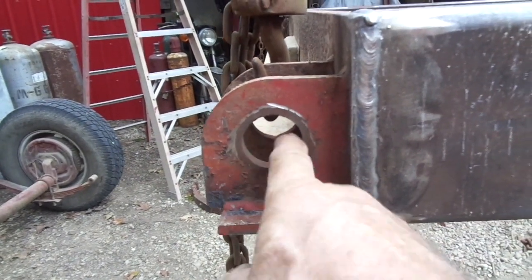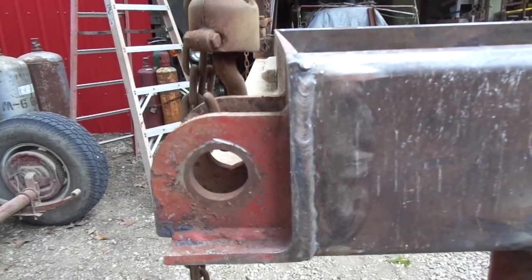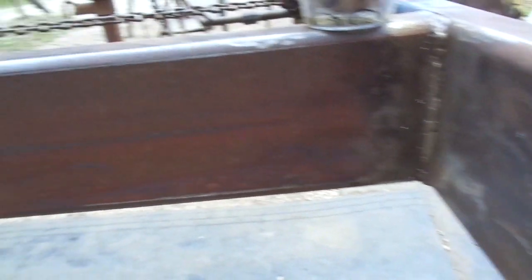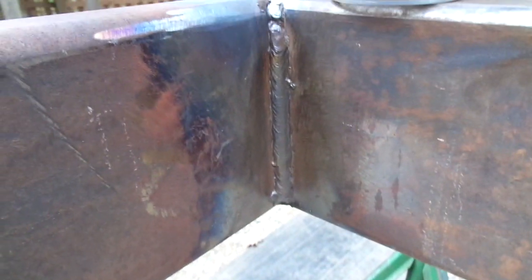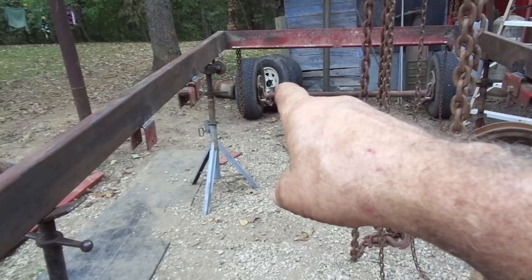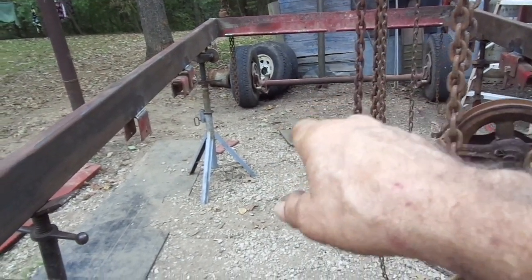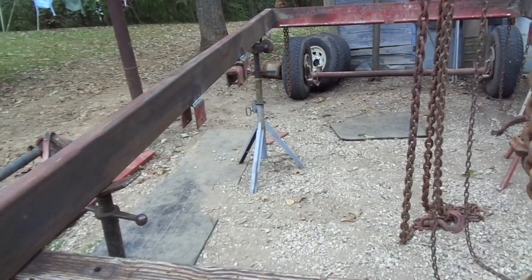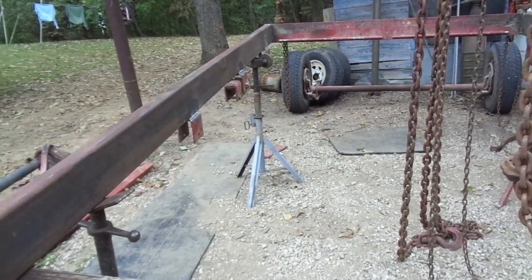This is the pivot here — an inch and a half pivot pin goes in there for the bed to dump on. And of course, here inside here on my crossmember. There's another vertical that's taller. If we're real lucky, the factory-welded spring perches on the axles will match up to the dimensions of the front shackle and the center bogeys — the shackles and bogeys.